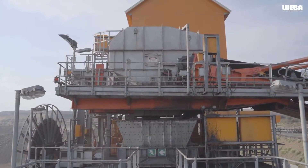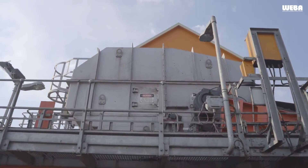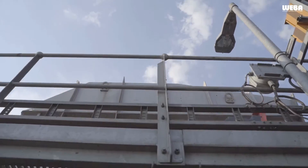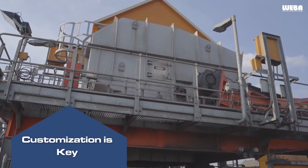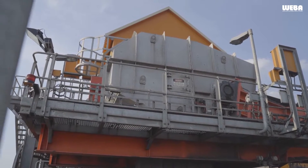In cases involving a head chute at the head end of the tripper conveyor line, the tripper chute can be flexibly designed to feed either the bins or bunkers below, or redirect material back onto the main tripper conveyor line, ensuring a seamless flow to the head end chute.